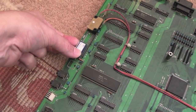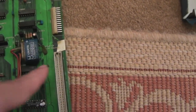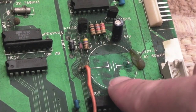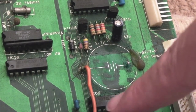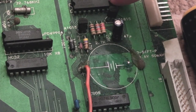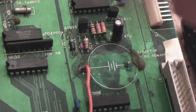I'll put all those DIP switches up. I'm tempted to give this a try as it is - I could just cut that battery connection off. You can see the corrosion is pretty bad where the battery was, and this IC down here - the LS05 - is eaten away a bit. Some of the traces here are a bit corroded, and the area above it has some corrosion as well, so we could have an issue around there - that might be the fault with this board.